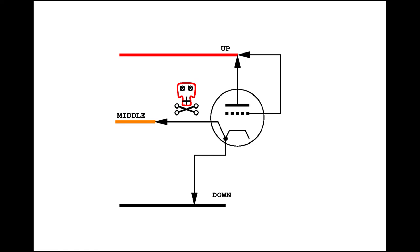If the short circuit appears between the lower and the middle position, that would involve the filament power line, which implies a significant current flow. That current would either damage the tube tester or would fuse the internal bond of the tube under test. This type of mistake is more likely to happen when the levers are moved to check for internal shorts or for open elements.